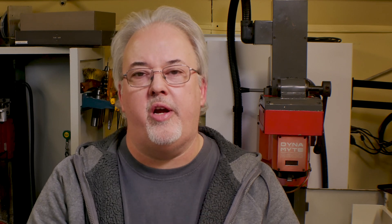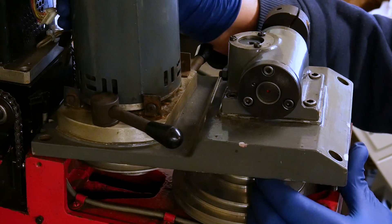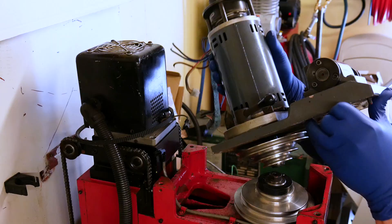One item that spent a whole lot of time on the back burner of this project was what to do about the spindle motor. The original machine used a brushless DC motor and drive, but unfortunately I couldn't find any information about interfacing to this system, so I was on the lookout for a replacement. Eventually I decided to try an AC servo motor. I initially picked a 750-watt motor from Dynamic Motor Motion (DMM Tech), and later upgraded to a 1-kilowatt motor. With all the cables, this package came in at $678.